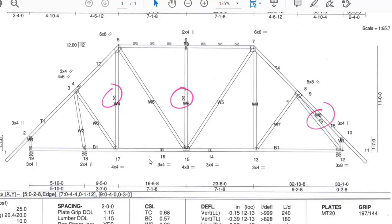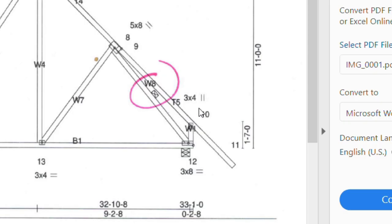If you're building a new home, one of the things you want to think about is your roof trusses and their actual design. Looking at one of my roof trusses, go to the bottom right-hand side — you'll notice there's a vertical piece of wood that goes from the bottom cord, which is just that bottom board, up to the top cord where your roof deck connects. That right there is called the heel, and your truss manufacturer is going to ask you what heel height you want. Your heel height is the distance between the top plate of your wall to the bottom of the roof deck.